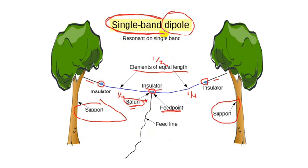It's a good idea to get it in the air as much as possible, with a goal of a half wavelength in the air. That's easier on the higher bands where lengths are shorter. Note that a dipole cut for 40 or 80 meters will not cover the entire band with an SWR of less than 2:1, so you will often have to choose which part of the band you use most.